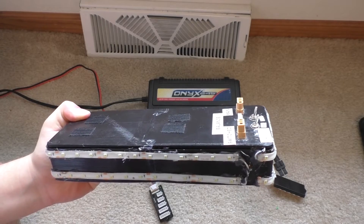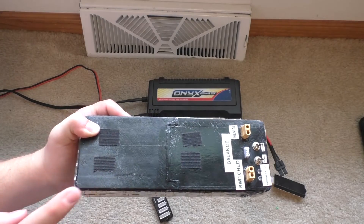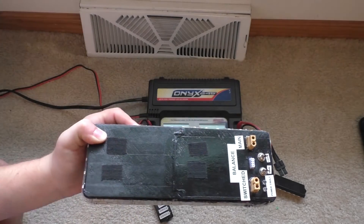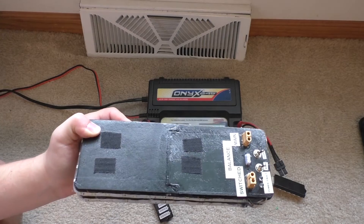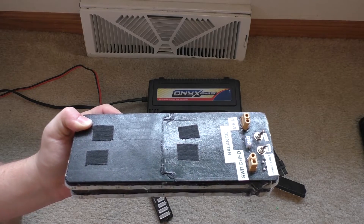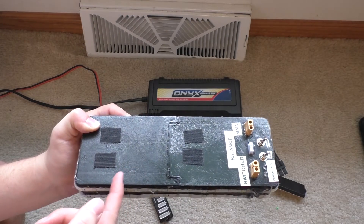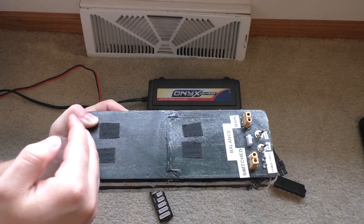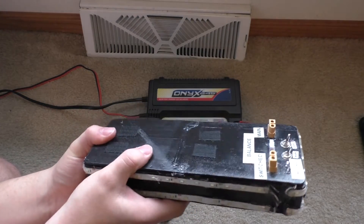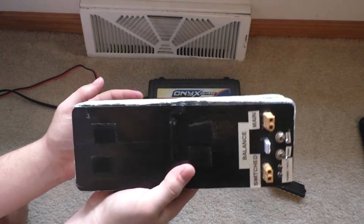This particular battery pack that I have here is 17.6 amp hours. If you have a 17.6 amp hour battery pack, the optimum charge current is 17.6 amps. Whatever the capacity is, that will be the optimum charging current, and that is known as the C rate. The C rate is the capacity — usually one C is charging at the capacity, so one C being 17.6 in this case means 17.6 amps.